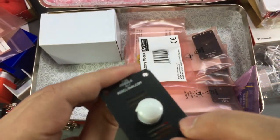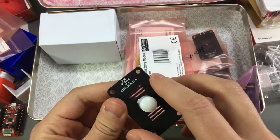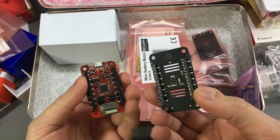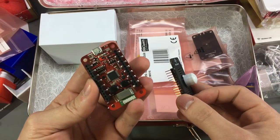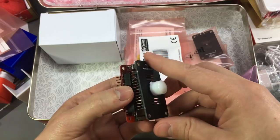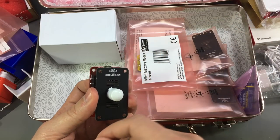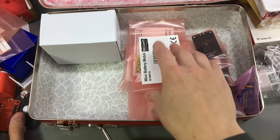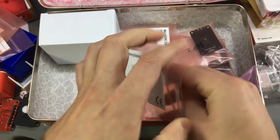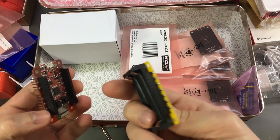This is a PIR module — just a small PIR sensor to detect presence inside a room, so this could be used in a home automation project. These sensor modules go on top of the base modules — something like this — and you get yourself a node that will broadcast to the gateway.